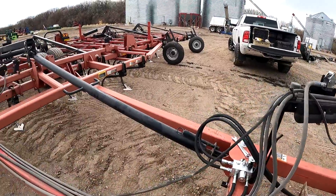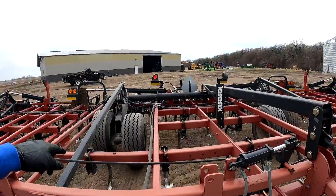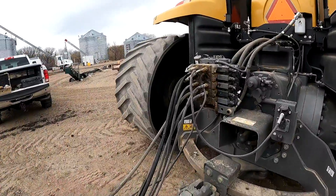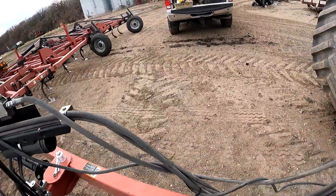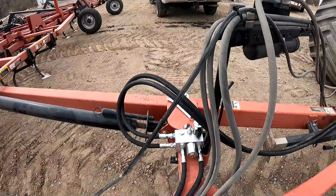One of the steps is figuring out your working side — we're looking for the base on this unit. It pushes down and shoves the rod out, so we follow the hoses up. A lot of times a farmer might have a zip tie on his units — like this guy, he double zip ties it to make sure he's got his working side and knows the direction correctly through the road locking valve.